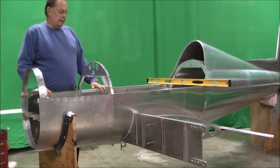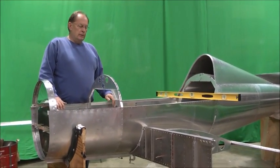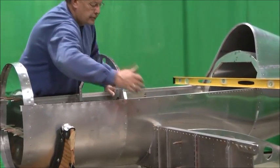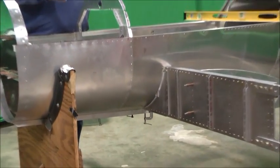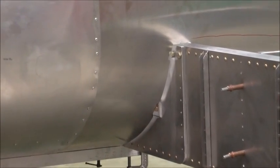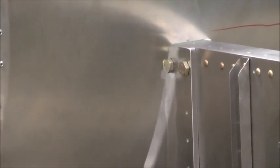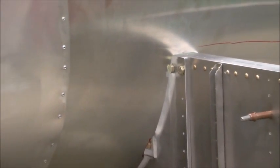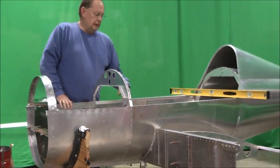One thing I'll point out, as you probably have noticed if you've been cutting and trying to fit this spar in, there's some little things like this hole right here that you got a notch for the bolts to slide through. That pattern is just a clearance pattern, so that should get you started. You may have to trim it up or down, or depending on how square your fuselage was built, you may have to clear a little bit of metal away, but you want to get it in place so it's sitting on the bottom rails in place.